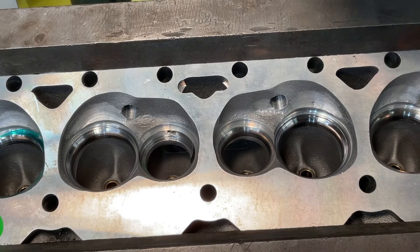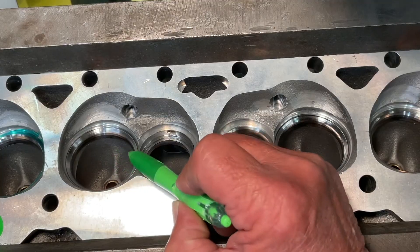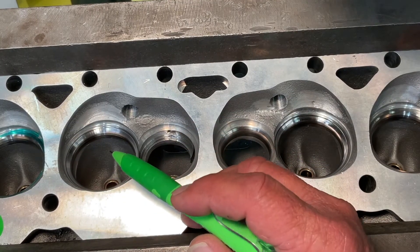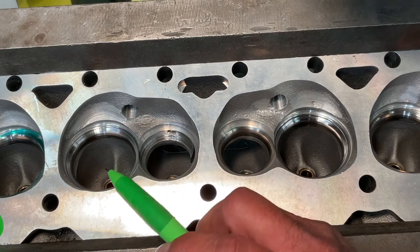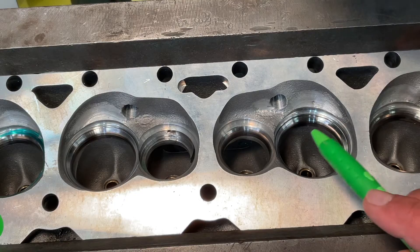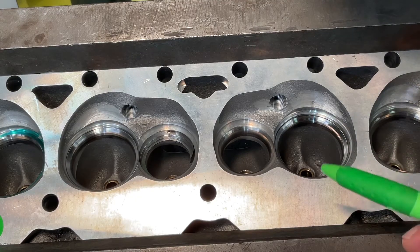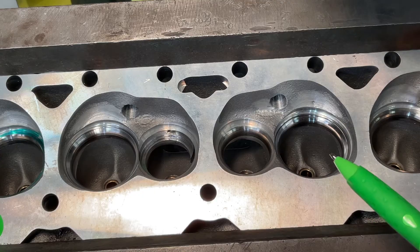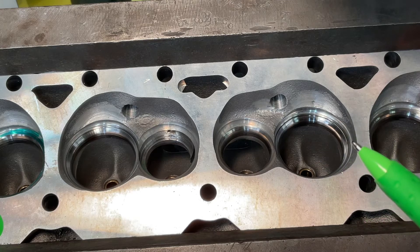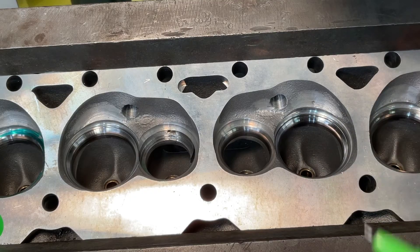Here's a close-up comparison of these valve seats. You can see I've got some chatter — that little bit of chatter you heard in the video — when cutting with the standard carbide on this hard alloy valve seat in this all-aluminum AFR cylinder head. It's going to be harder; it's not your standard cast iron Chevy or Ford valve seat at all. But look over here where I cut with the Saber-Tooth — no chatter at all. This is a beautifully cut seat all the way around. There's some light refraction because it's very difficult to shoot shiny things without reflection, but the standard carbide did a good job getting the angle set — you can just see that little chatter. Back over here with the Saber-Tooth: no chatter, cut right through that harder alloy. That's the performance, that's the long life, and those are the results you'll get with the new Saber-Tooth series.